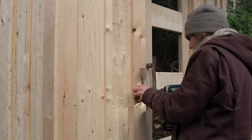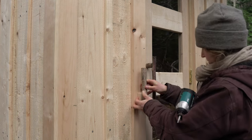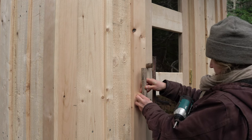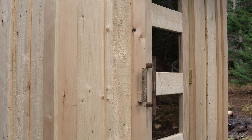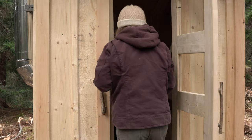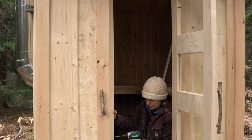I'll link to all the stuff that was useful to me in the description. The only thing with the jig is that it doesn't work on anything thicker than a 2x4, so I wasn't able to recess the hinge on the frame, but it doesn't leave that big of a gap, so it's totally fine. Plus, the doorstop trim that I'm installing here helps to hide the gaps.